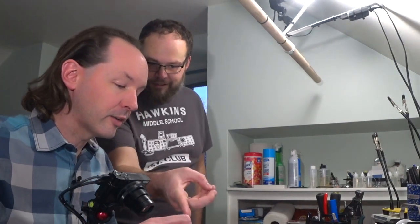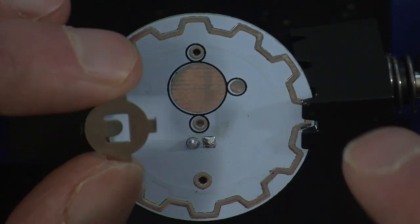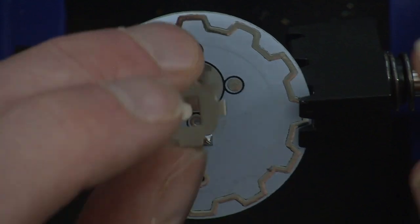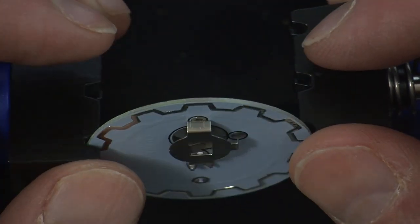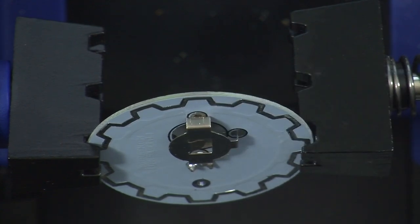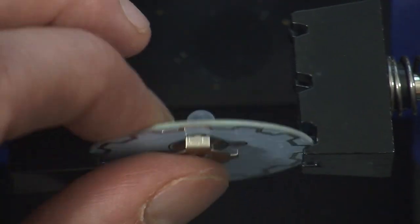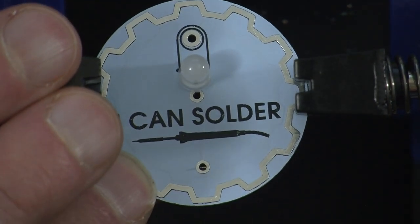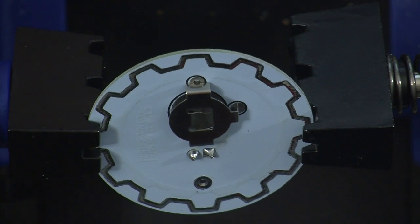For small stuff like this — do I put the heat this way? I would. It looks like it's set up for it to touch once the legs go down. Yep, it'll touch. So I solder all three? Yep. Alright, so this solders from this side even though it's sticking up through the other side. I got pads here. I would flip it back over and tack this side — okay I see, I'm with you.